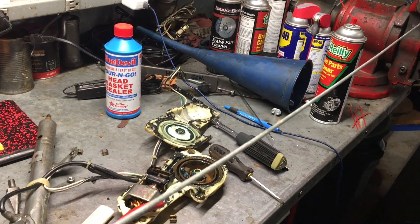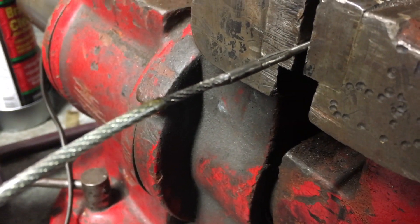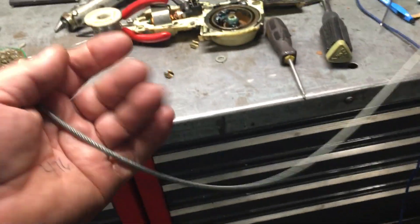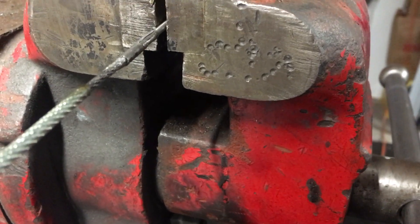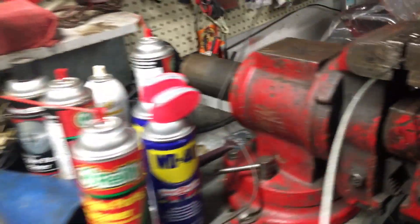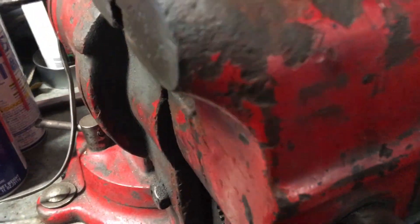Let's get it back in there and check it. This will allow me to zoom in — that's about as far as it goes before losing focus. We can see that cable. I'm pulling hard and it's passing the test. The problem was that the mast, on the end, has a thread — it threads into that little tiny brass boss where you solder it in.